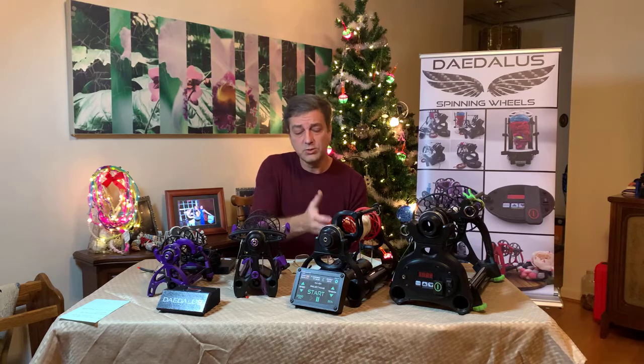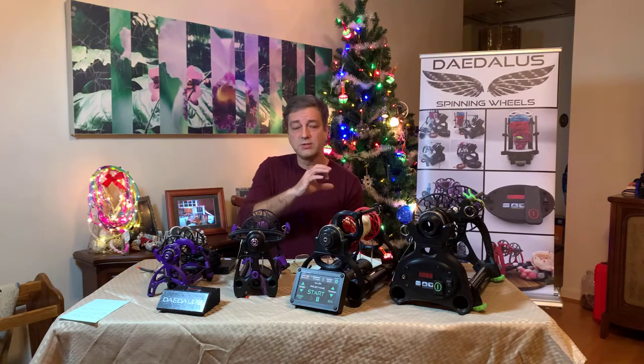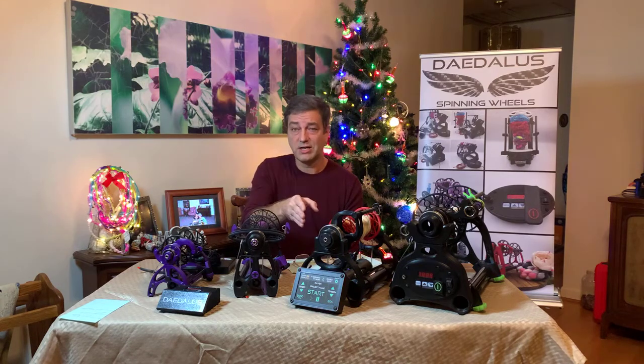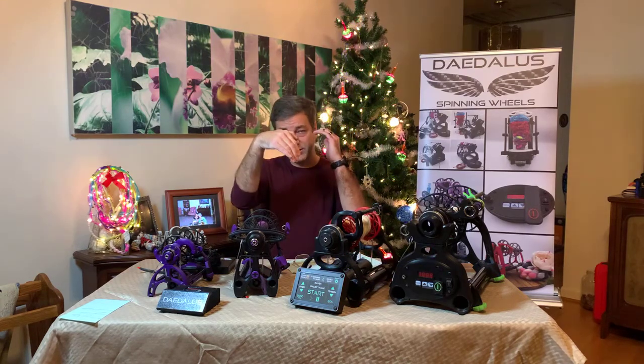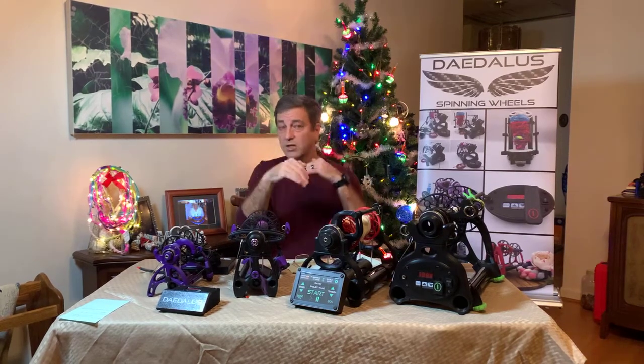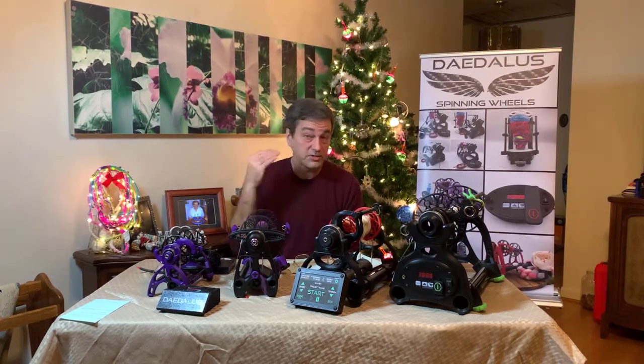The change to a dual motor doesn't use a slip system. It uses the same rubber belt as the front drive motor. So the flyer is driven with a rubber belt. The bobbin is driven with a rubber belt all at the same time. Those rubber belts last forever.